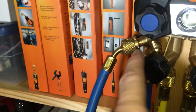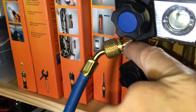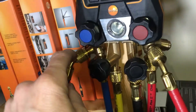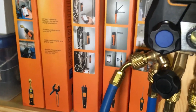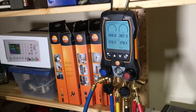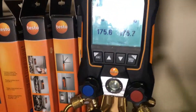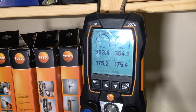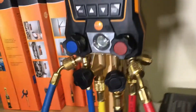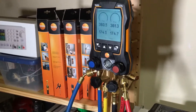My guess is when I put some big blue on here, it's going to be leaking out of the seal right at the threads — maybe at the very back of the fitting right here. But the gasket that looks good to the eye is apparently leaking right there. We're going to find out what the real truth behind the failure was yesterday on failing the nitrogen pressure decay test. Right now it's leaking really fast — it was not leaking like this yesterday. This big of a leak is a new development. As you can see, it's bleeding down in tenths of a single psi. I think putting my ear up here right now, I barely hear something. We've got to pinpoint it.